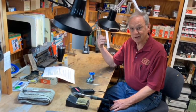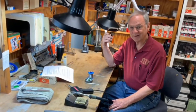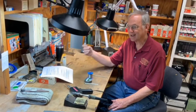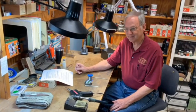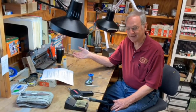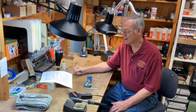Soldering aluminum is much more difficult. There are special solders that can be used, but I would not advise trying that unless you're in industry. Soldering white metal castings you cannot do — ask me how I know that. What happens is that the melting point of white metal is about the same as the solder, and your casting turns into a small puddle.